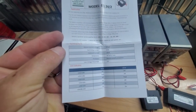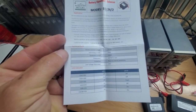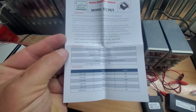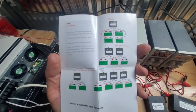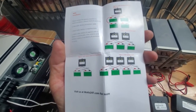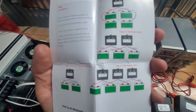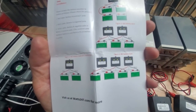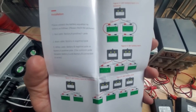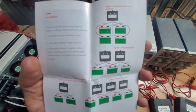This unit can balance up to 10 amps. So if you've got one battery sitting at 12.1 volts and another at 12.6 volts, it'll use up to 10 amps to balance those two while you don't have to do anything. There are simple instructions on the back. You can even daisy chain two 24-volt units to make a 48-volt or 36-volt unit — you can keep going to hundreds of volts. These only work with 12-volt cells, up to 14.4 volts and down to 10 volts.